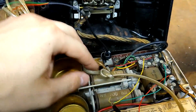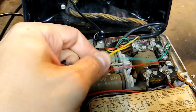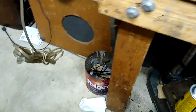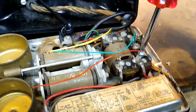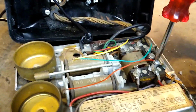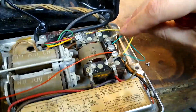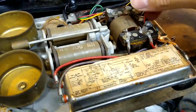So we've taken the old cord out of circulation there. I'm actually just gonna yank it off these wires. They're nicely color-coded so I can see what I did. And this is going into the trash because it's ruined and old and not old enough to be antique and interesting. I take off the old red wire and the green wire and replace them with the new red and green wire one at a time. I'm also going to reuse this yellow wire here and use it to bridge to the green terminal. Let's just do things one at a time to get it cleaned up.